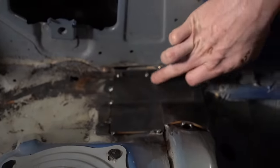A couple cages that I've seen actually, they do not do a good job in these cars. These cars are pretty tricky because the main hoop's actually quite a bit lower than the front of the car, so the tubes need to go up a lot, down, make a couple weird corrections and bends, and then finally land at the base. So there's a couple things different with this that don't necessarily apply to the regular chassis, like a 240, for example, super easy. BMWs are pretty easy, and so on.